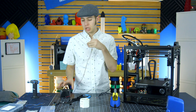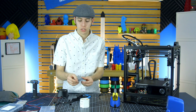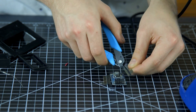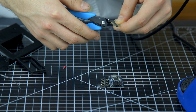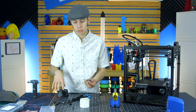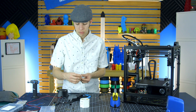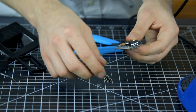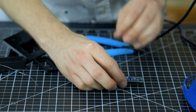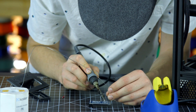The next step is to get the actual audio effects board soldered up. It comes with some pins — I picked the version that has amplifiers on it. I could do a left and right speaker, but I'm just using one because it's more than enough. I'll stick the pins through the holes from the back, flip it over, put some solder on, and that'll keep them attached.